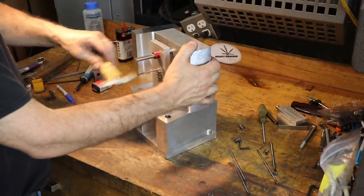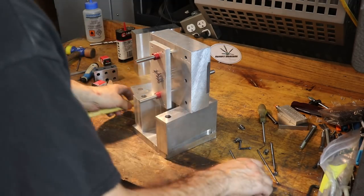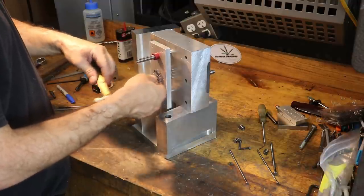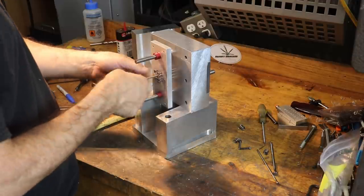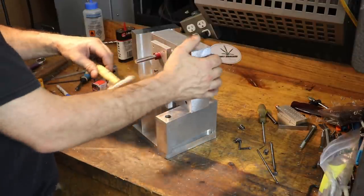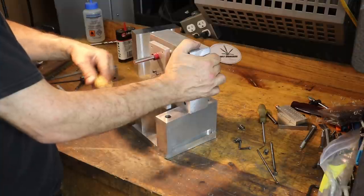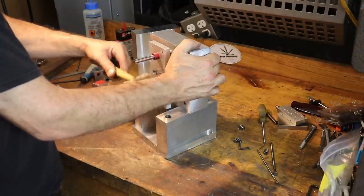For really high production molds, it can be, because they'll start galling up, like 100,000 cycles later. But this is going to be maybe 2,000 total parts for the life of the mold, which is like 2 days of running, so I'm not too worried about it. So we're vibrating and shimmying and convincing these pins to find all of their little chamfered holes.